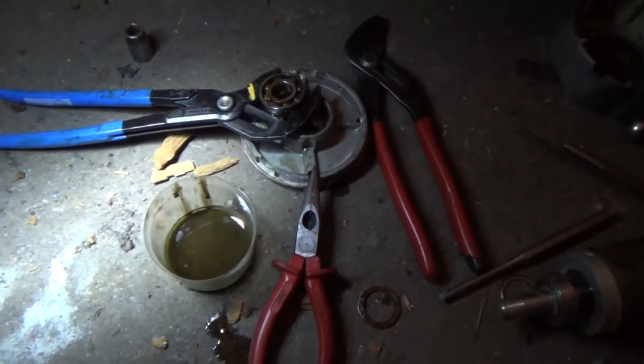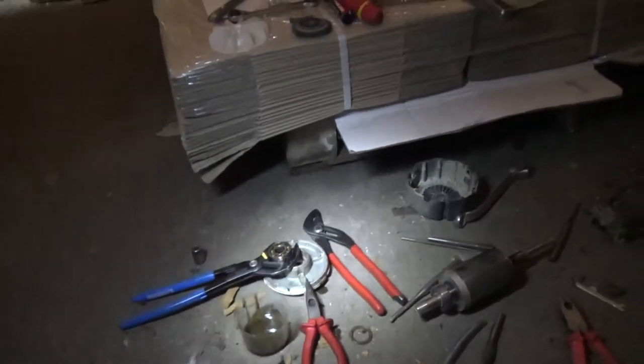We've got it running, got it back together. These little brass-headed pumps seize up quite easily. This one has been sat for 15 years, which is a long time. Quite often you have to take them apart and get a file on the brass impeller to clean it up a bit. I think we might have put a few dings in there because we were trying to turn it forcibly when we first tried, so when I put it back together and put the power on, it wouldn't start.